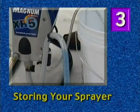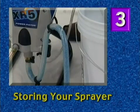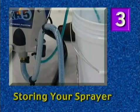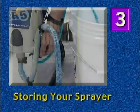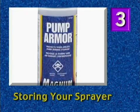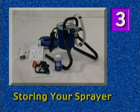Now that your sprayer is clean, you'll want to prepare it for storage. You never want to leave water in the pump for any length of time because water is corrosive and can cause considerable damage to the sprayer's pump. To protect and store your Magnum sprayer, you'll need to replace the water with a storage fluid such as Magnum Pump Armor. We have included a small sample of Magnum Pump Armor along with your sprayer, and more can be purchased at your local Graco retailer.